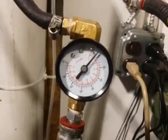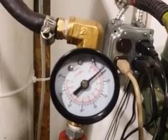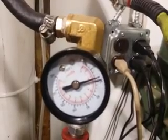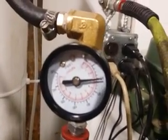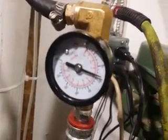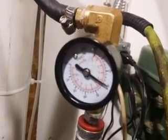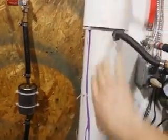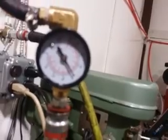Pressure is rising. I'm going to take it up to 80 PSI, slowly creeping up. The CIS injectors are standard — they usually open at about 45 PSI, 45 to 50 depending on the vehicle. Lower horsepower engines obviously need less pressure, and it also depends on the injector itself. Alright, we've crept up on 80. Securing line pressure — the pressure vessel is fully pressurized to 80 PSI and holding pretty well, right where it should be.